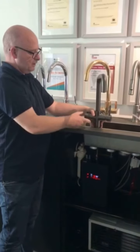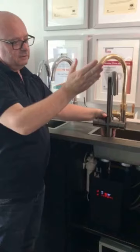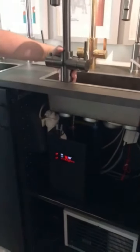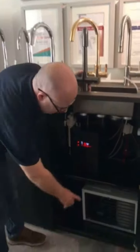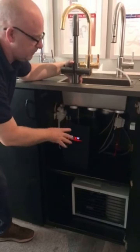And of course, keeping it separate on this side of the tap, you push it and turn it and that will deliver your boiling water. So it's two plumbing installations in real terms: one is a plumbing installation for the boiling water tap, and the other is a plumbing installation which goes through the boiling water tap for the chilled water. It's very simple — all that does is it tees into the two pieces of pipe that are already supplied.